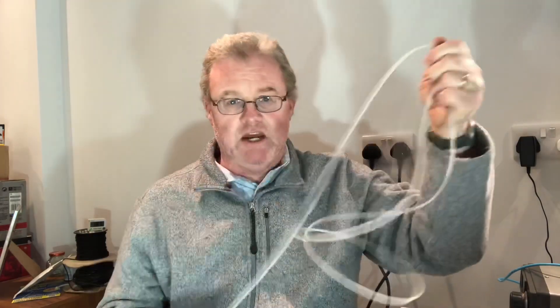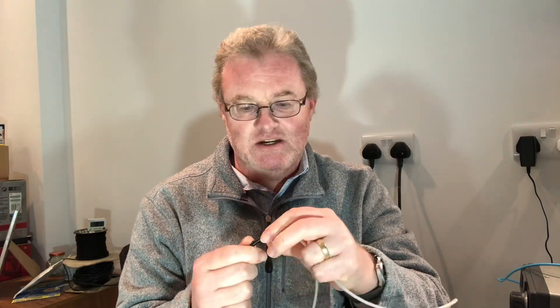I've had one or two questions from the other two videos about exactly what the design of the antenna is, so I'm going to describe it. Effectively, one half of the antenna is literally stripped-back coax — you've got the outer bit and the inner braid, and you strip that back. This is the top half of the antenna, and the top half goes to basically the halfway point. Then the second half is the untouched coax. I've put some tape there to stop any water ingress — heat shrink is probably better to prevent water getting into the coax.